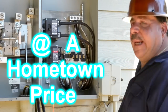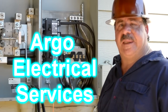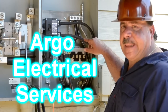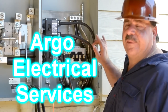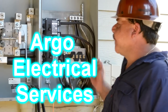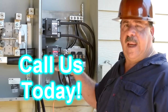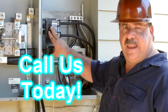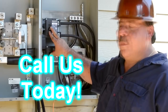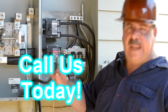There were two existing grounds and we added a new one with an eight-foot ground rod to increase the grounding ability of this system. Also, you have four aluminum neutrals for each respective circuit and four aluminum grounds that are both lugged to the neutral bar for the 400 amp service. All of these are coated with no-lox. Curtis has left your 200 amp circuit breakers for A and B existing panels in the off position, keeping any existing load off the system when the power provider — in this case Cobb EMC — turns the power back on.